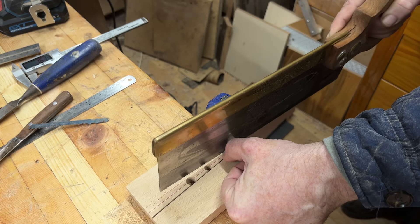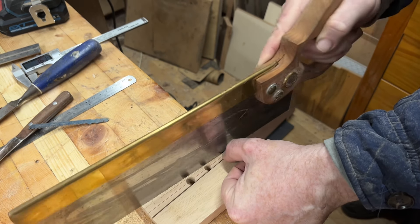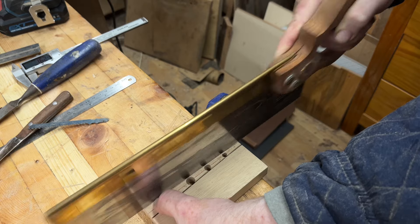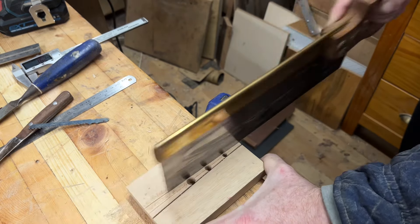Just a quick note from editing Dean: I didn't cut my lines to the outside, meaning the dowels turned out ever so slightly smaller than I would have liked — but only a small amount. Cut to the outside of the line you've drawn, not on the line, because the kerf of the blade will start encroaching onto the size of the dowels you're going to make. Just wanted to share that. Let's get back to it — going along that front edge a little bit.